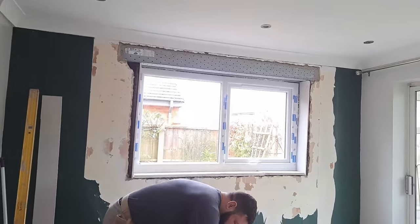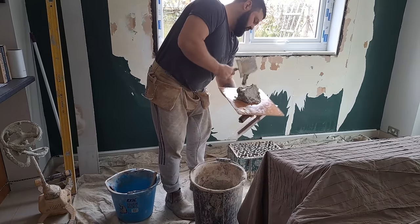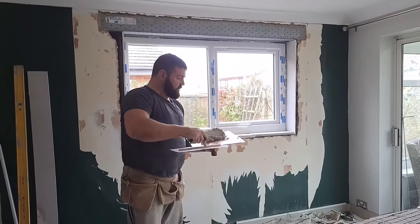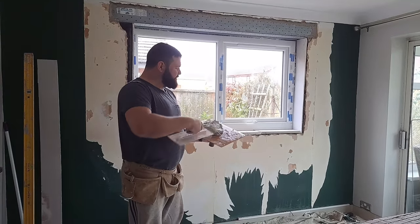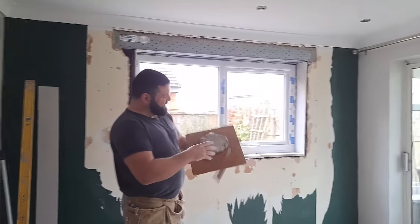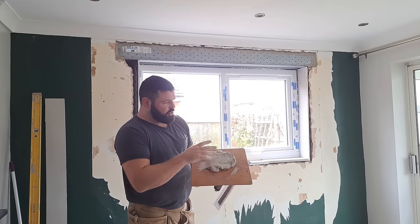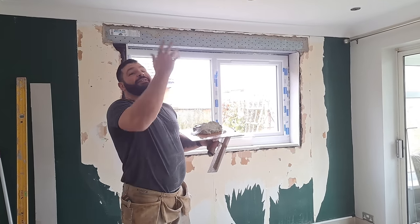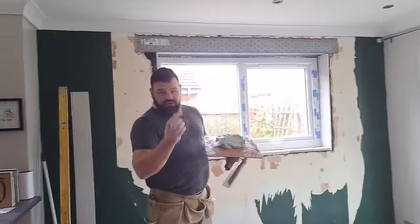But now, the other form of suction we talk about is when you get some plaster and it has suction like that. Now that's a different type of suction. That's not the same suction that we're dealing with when we're SBRing. That's sticking to that because this material is wet, so it has its own sort of, it's like when you throw some kids' slime and it sticks to the ceiling. It's a different type of suction. We're not talking about the suction where it draws the moisture out.